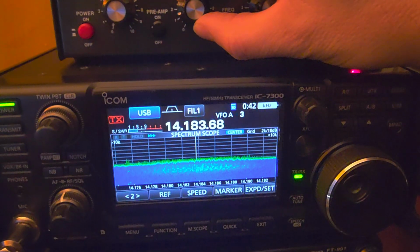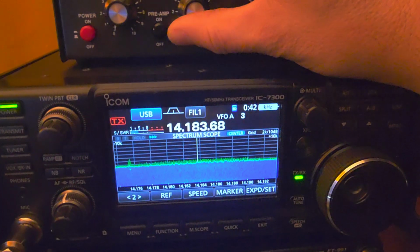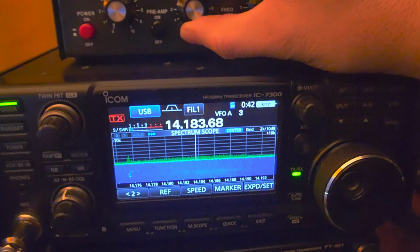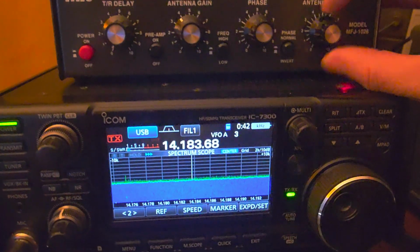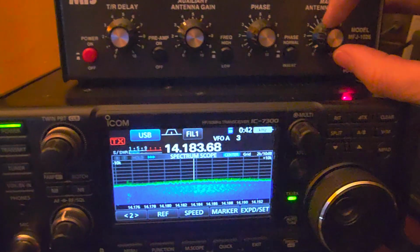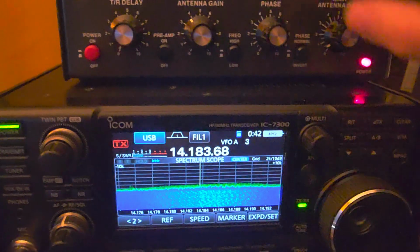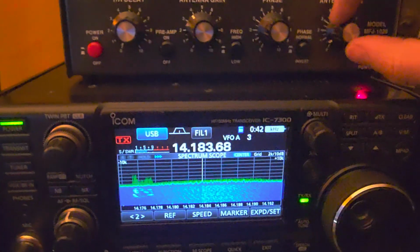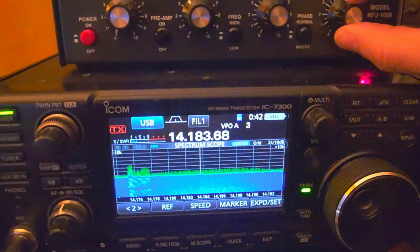I'm just looking at the middle spot between the two of those. So yeah, it looks like maybe around 4. Same thing with the main. If you adjust the main too low, as you see, the noise comes back up. Even though my receive gain has gone down, because these two are not matching in signal strength, the noise comes up. So we want to bring that gain up.